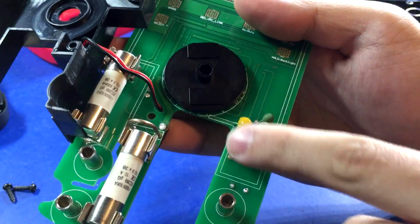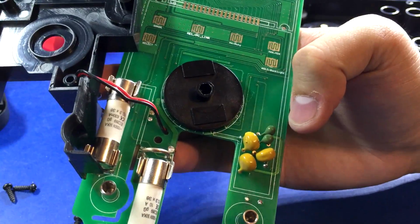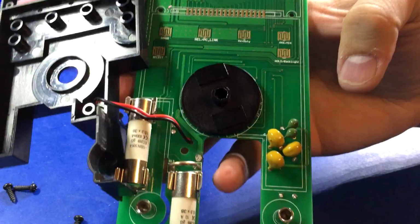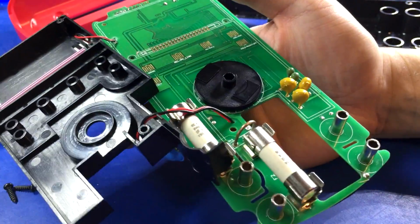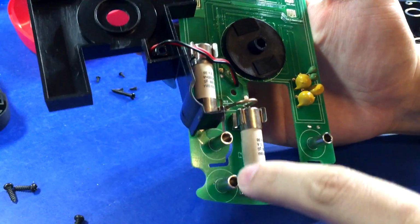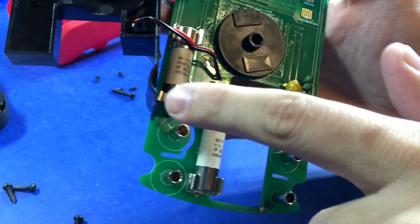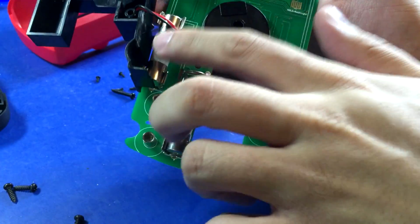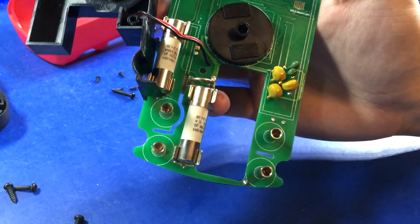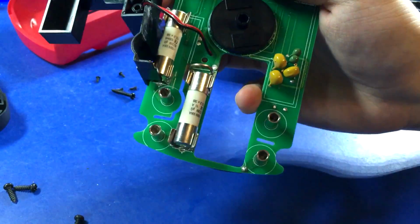Tons and tons and tons of poly switches up in this section right here, which is always good. So that's really all she wrote, though. There's nothing to this thing. So yeah, really impressive input protection, though. I mean, it's got isolation slots, the Fluke type too, where it goes through the actual PCB. It's got 2 of the large sized ceramic fuses. Nice clean looking shunt that's a little close to that fuse.